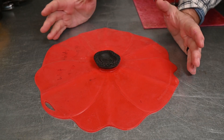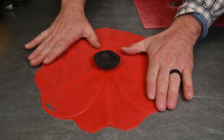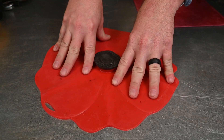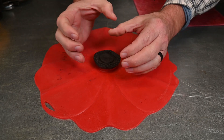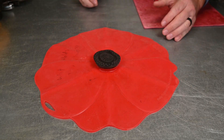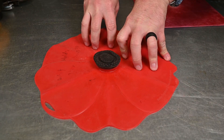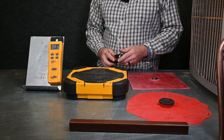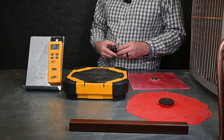When we think about suction cups or things like this, it's all about surface area. The bigger that cup is, the more square inches there are to push down and create that pressure difference. The smaller the area, the fewer pounds per square inch of atmospheric air there are to push against it. So it's all about atmospheric pressure.